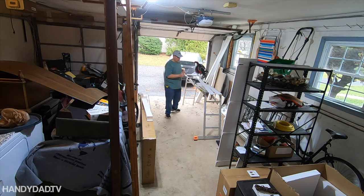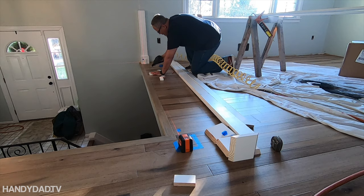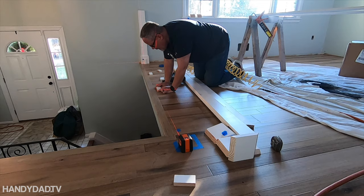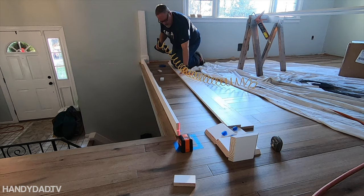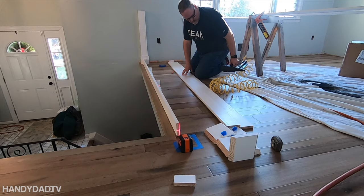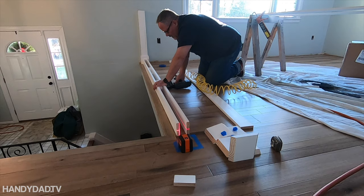The next thing I'm working on is the rails that go between the posts on the bottom. They're made from three 1x4s, but they have spacer blocks that are an inch and three-quarters wide. The two boards run parallel to each other, an inch and three-quarters apart, and then there will be a cap board across the top — that's what the railing will actually sit on. The spacer blocks are nailed to the floor, and I use a laser level to keep everything nice and straight, with a couple more spacer blocks placed vertically to help keep the boards parallel.